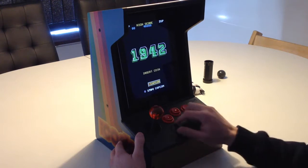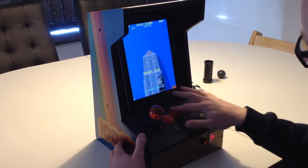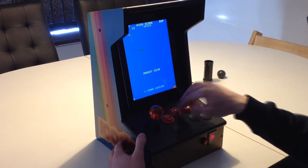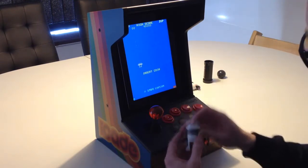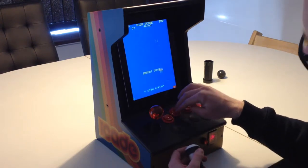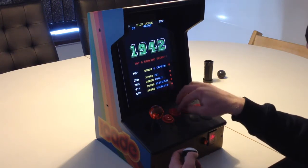I've also chosen to swap out the buttons. I found some buttons that don't make any noise, called Gold Leaf Switches, which you can buy from Ultimarc. They have the same concave shape as classic arcade buttons, but they don't have a micro switch like a Cherry Switch. The original buttons clicked very loudly with a standard Cherry switch. These Gold Leaf ones feel like a classic arcade button on the outside, but inside they don't need to be pressed all the way to the bottom to activate - they actually feel like Japanese buttons.